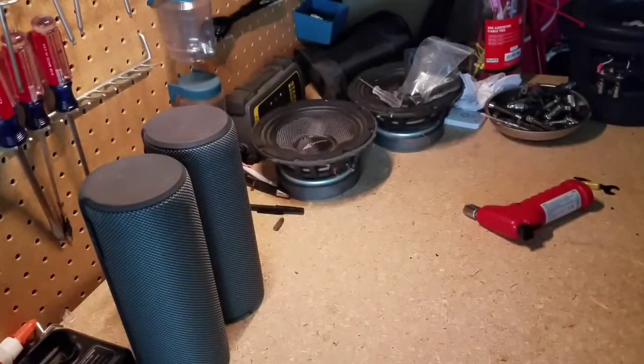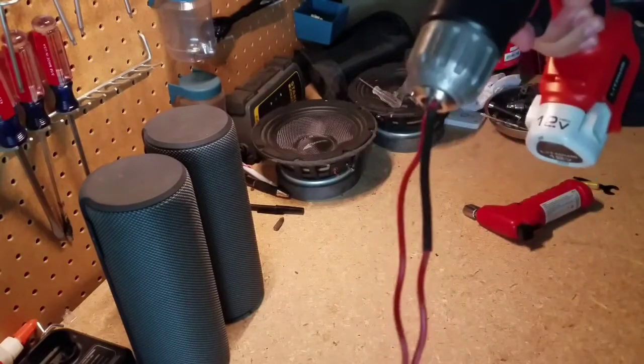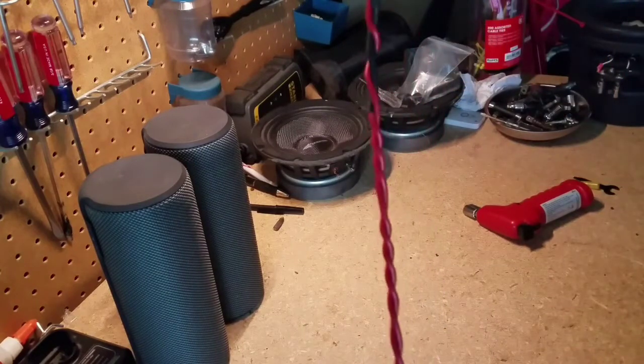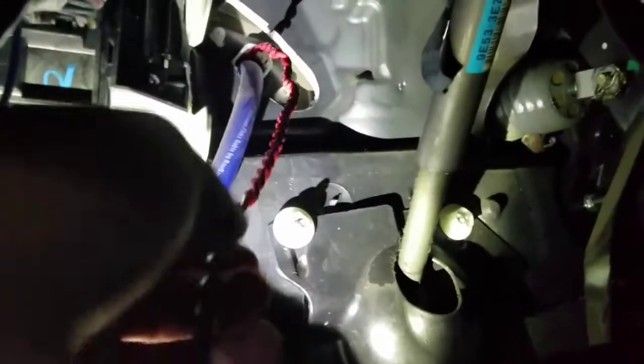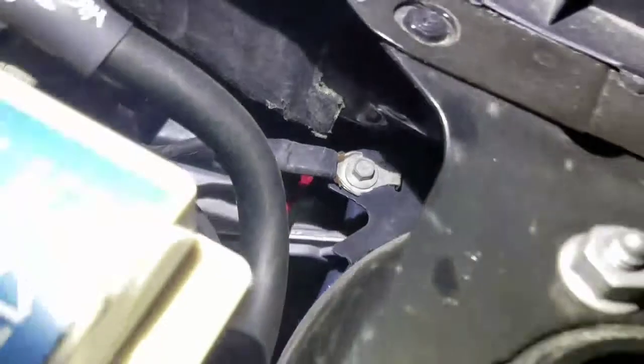One thing I like to do before the next step is tangle — or twist — the wires together so I can get both of them through at one time. Get your drill, tighten the two wires inside, hold it in place, and let it turn. And continue on. Next step: run the wire through. I can see it on the other side — it should be right where we put it through, which would be right there. Let's pull that wire through.